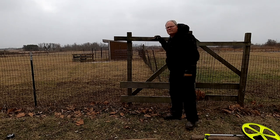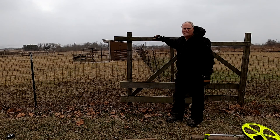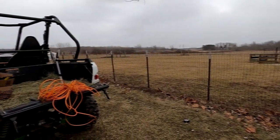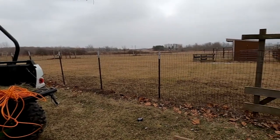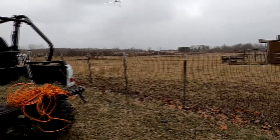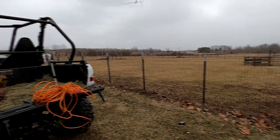So that's good. So these wooden posts, like I said, they've been here since 2006. Some of them have got frost heave, and I don't know if you can see over there, especially, and also in the other corner. If it shows up or not, I don't know. But you can see they're not really perfectly vertical and not the way they're supposed to be, and that's because I didn't get the post deep enough.